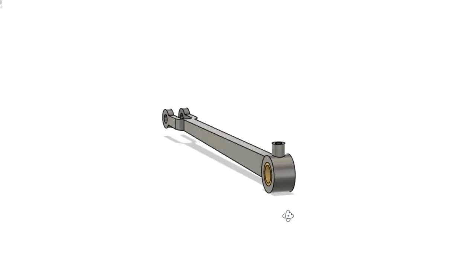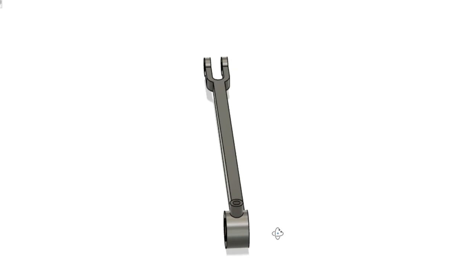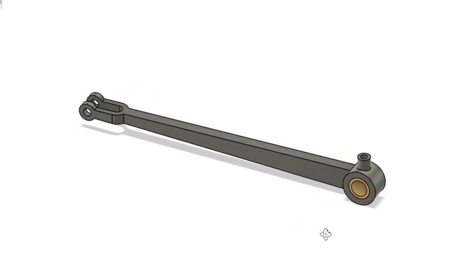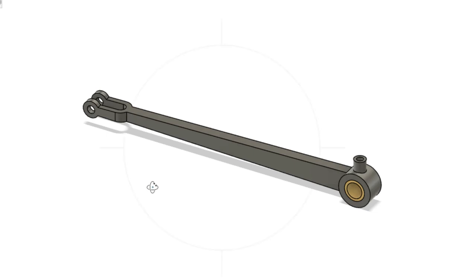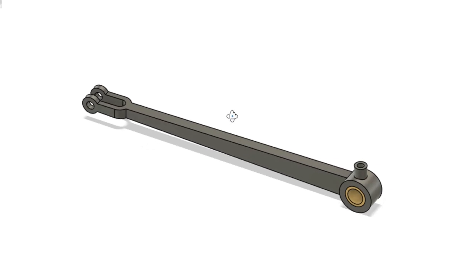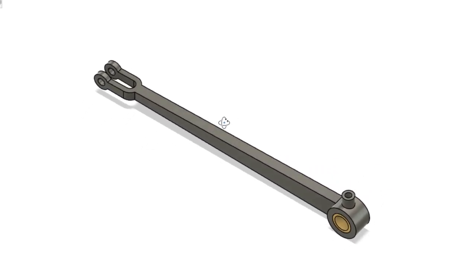The eccentric rods will be another fairly complex pair of parts to make. Don calls out gauge plate with the bronze boss at the end. But again, I'll be working with mild steel. Likewise for the boss, but I will fit a phosphor bronze bush into it.